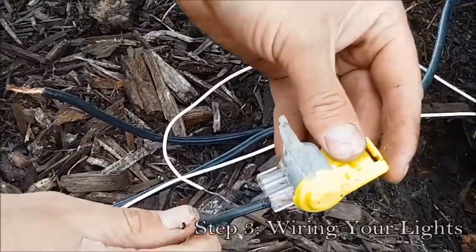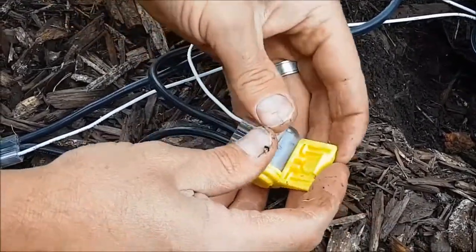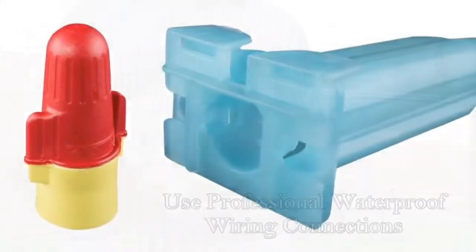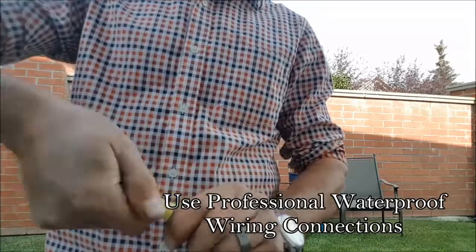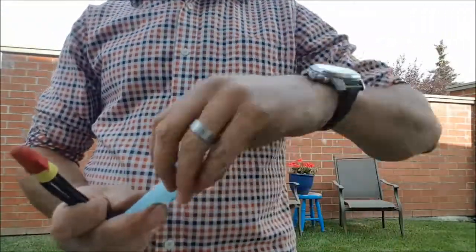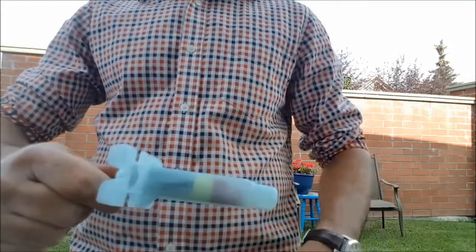From there you start laying out your wire. Once you've got all your lights in place, be sure to leave extra wire at every fixture just to give yourself some wiggle room. Connecting the lights is quite simple — when you make your splice in your wire, you'll have a wire going in and a wire going out for each connection as well as your fixture wire, and at every light you're going to have two of those connections. I recommend a good waterproof connection, either a gel-filled snap lock connector or gel-filled DBY connectors that come in two parts with a nut that screws on and keeps the wires tight, filling into a gel-filled tube that keeps the water out.